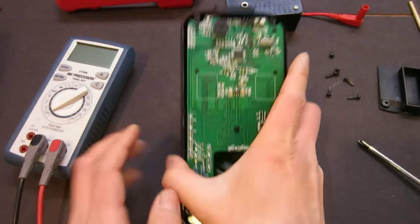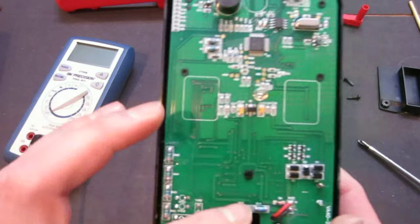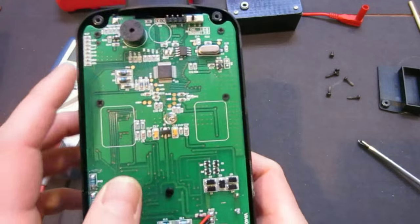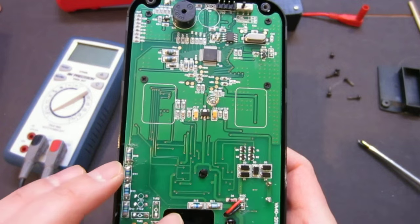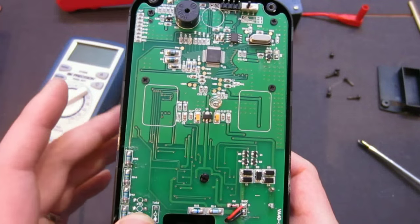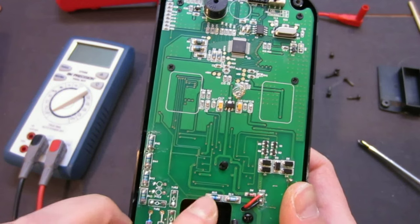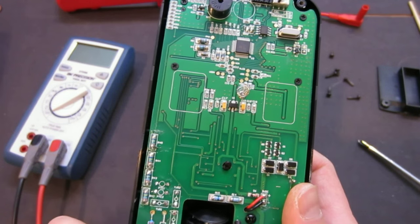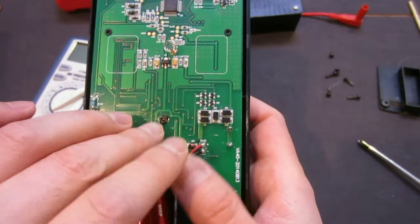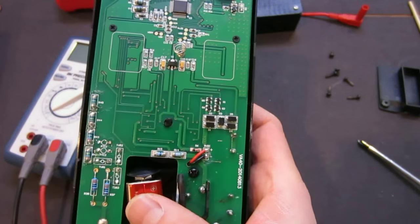So potentially, it depends on how the rest of the circuit works, we can actually, let's turn it off first. We can actually use this battery. This battery can probably drop to very low voltage before this whole thing stops working because this is a 3-volt regulator. So we have a large margin of the voltage here. Unfortunately, this does waste a lot of energy because it's a linear regulator and so the same current flows through no matter what.